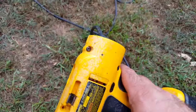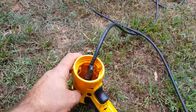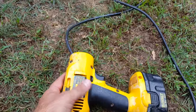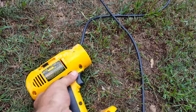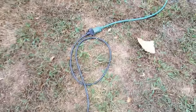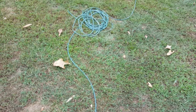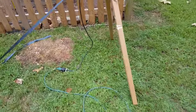What I did was I took the motor out and used the wires that were connected to the motor, connecting them to this cord here. I left the switch mechanism in with the variable speed switch and the forward and reverse still connected, ran this wire out, and put a plug on the end of it — just a household plug. Plug that into an extension cord, so my extension cord can be however long I need.